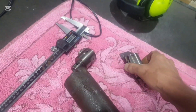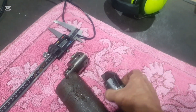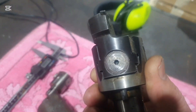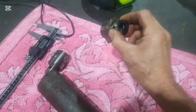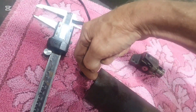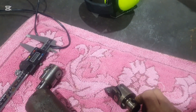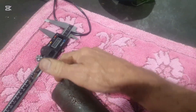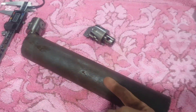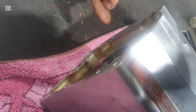The boring head is going to be attached on the end of that accurately, so I'm going to have to make a sleeve and accurately put it on there, back off the head so I can come up on size accurately. It's got a micrometer that works in hundredths of a millimeter, so that'll work well. It's got an M12 thread in it, so I'll use that drive dowel there and drill a little mating hole for it. That drive dowel will do all the driving, and this will be an accurately bored sleeve. I'll run an all-thread right here with an accurate nut on the back — and that nut is what we're going to drive it through with.